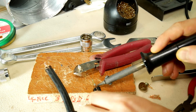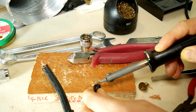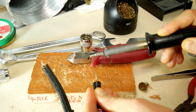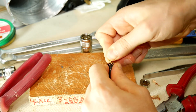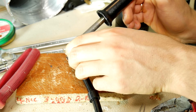Now is the time for one of the most difficult tasks in this video. We need to remove the central wire cord pin needle so that we can put the needle back on the new cable. If there is no central pin needle, then you will have to buy a new N-type connector. We need to get this central pin onto the central core of the new cable — this will be the hardest task. When the central pin is successfully placed in its position, solder it to the new cable.